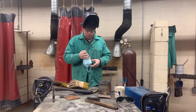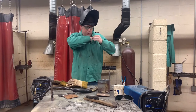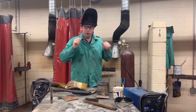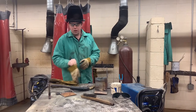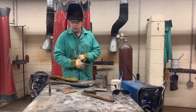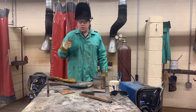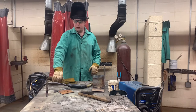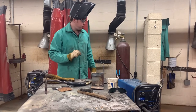Y'all are back 12 feet, so I'm going to remove this so you can hear me and I can weld without my glasses fogging up. We're going to start with the welder. This is a gas metal arc welder, GMAW or wire welder. You need a few things: a Shade 10 helmet, safety glasses, welding gloves — insulated welding gloves — and a fireproof jacket.